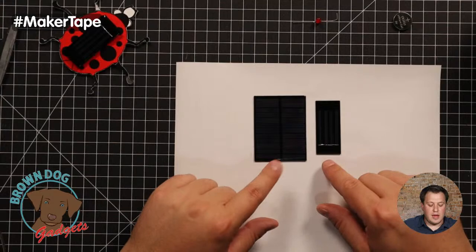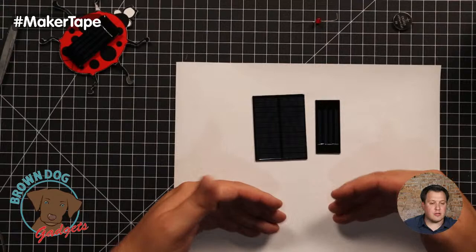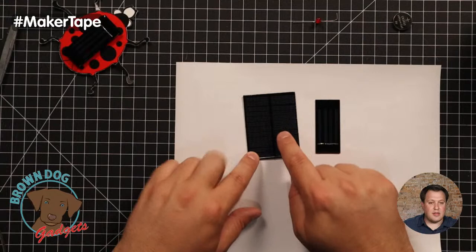And it's an easy topic for kids to understand and use because it's simple and it's low voltage. Yeah. And there's an immediate output, immediate result from doing projects. Buy an old garden light or go to the Dollar Tree and buy garden lights. Great way to get some little solar things to look at and take apart because it's a dollar. If you can, get the ones with panels that look like this, not the clear ones that look like calculator panels. Those are glass and really tough to take apart.